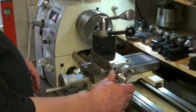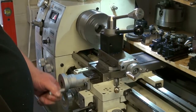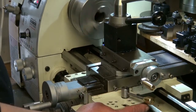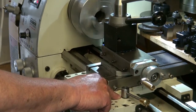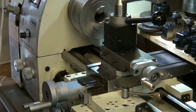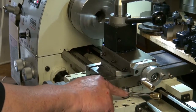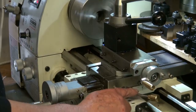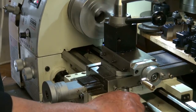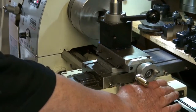The other thing was the carriage lock. If you can see that. Carriage lock here was just an Allen bolt, and you have to use an Allen key. There again, it's on your wick when you're trying to find the Allen key all the time, and fitting it in there blind was difficult. So I made a new Allen bolt with a big head on it, slightly angled rod, and a lovely little brass end like that. So now you can just lock the carriage and unlock it at ease.